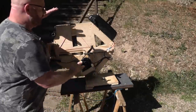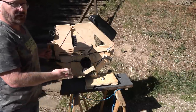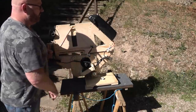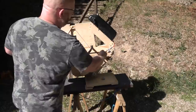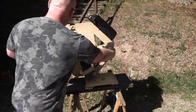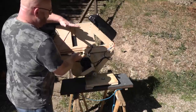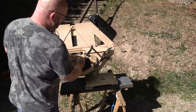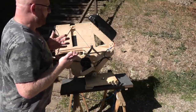Then people are saying make it more compact, make it portable. That doesn't work. See, this is like the smallest engine with such torque that I could possibly find. Next in line would be the battery drills, but we've seen that those don't have enough power for a full blown crossbow. You cannot make it any shorter, because you need the distance for the rack and pinion mechanism — where is it going to go if you need to reset it? So the length is already as short as possible. Same goes for the height: if I shorten this, then immediately the mag capacity would go down, and we don't want that. We also cannot shorten it from below, because the engine needs the space. I haven't wasted anything. I think I'm trying to say that I already made it as compact as possible.